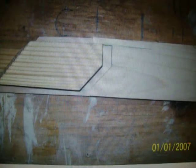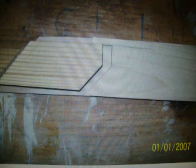Mill down some maple to about a quarter inch thick. The outsides were about a quarter inch thick and the three inner pieces were a little bit under, like 3 sixteenths or something. Put them into place from the edge — you can see it's like laminating them together. I alternated the grain in all different directions so none of them lined up, just to add strength.